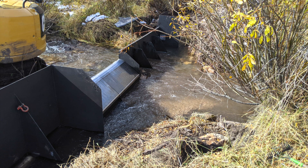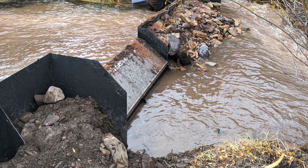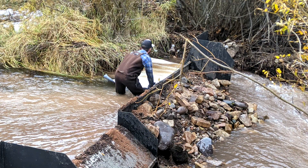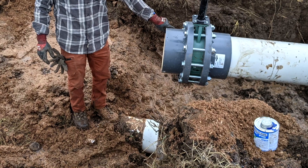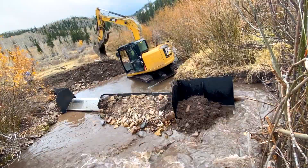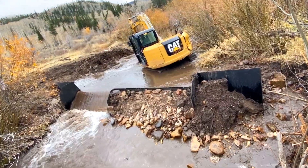With the remainder of the Coanda screen installed, you can see the diversion pipe revealed under the water. Then heavy fill material was placed on the downstream side. A non-permeable membrane was positioned at the far end of the wall. The water nearest the camera is blocked and the necessary fittings are installed and buried, with a 12 inch wafer butterfly valve then being connected. The excavator goes to work filling in the temporary diversion of water around the wall, which restricts the water outflow and channels the stream to its intended course flowing over the Coanda screen.